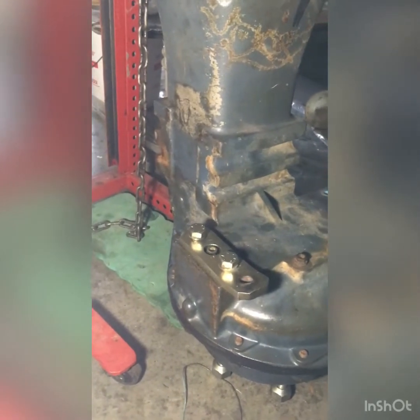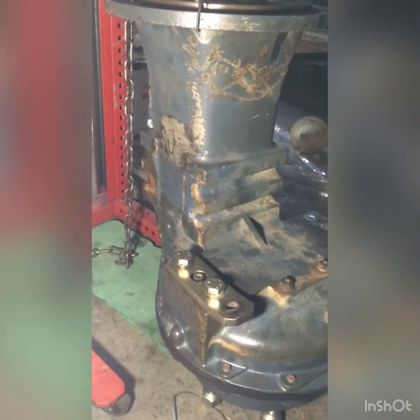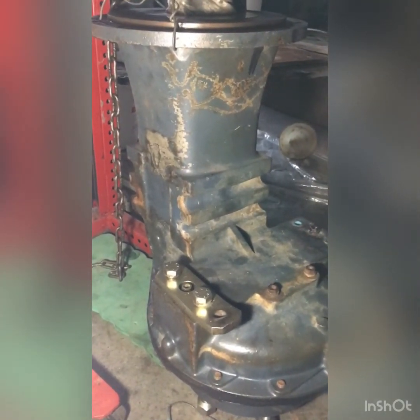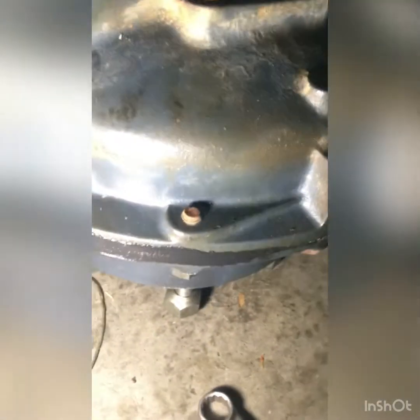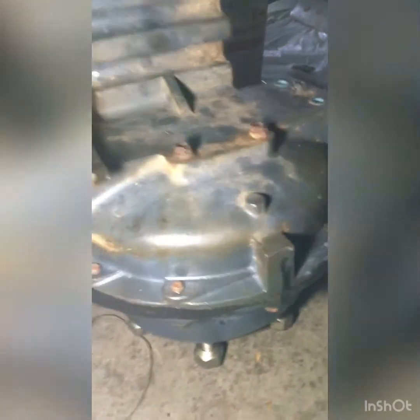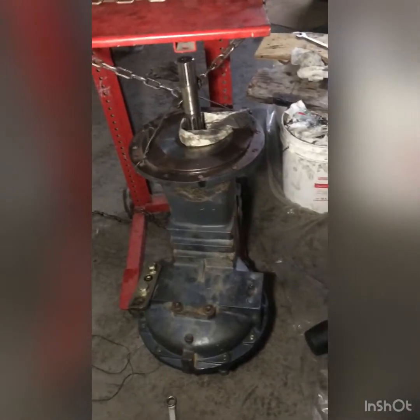And in order to align the pin, instead of knocking with a hammer or something like that, we decided to just screw in the bolt, and it went very smoothly because the pins are press fit. This is an alignment pin. There is one here and one on the other side, same place. You can see here the seal is actually bleeding, or anyway, he actually cleaned the excess. Anyway, to me there's not that much, but it was my father and I. So I think we've done it right.